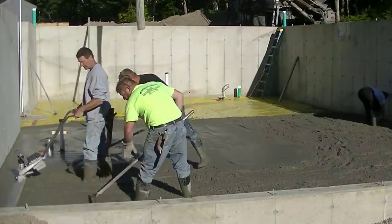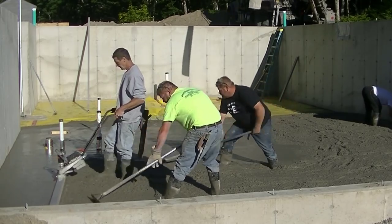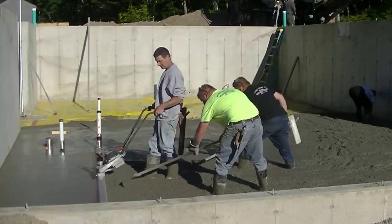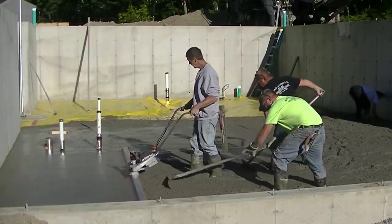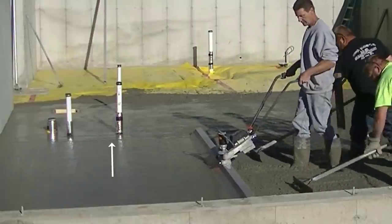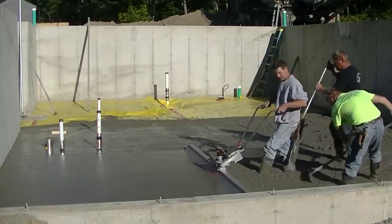Now you can watch me using this power screed. This is the Screed Demon from MBW — this is their new battery operated one, and I've got a link for it down in the description. Look at the effort I'm putting into this — it's very little effort to screed using this. Really the two guys raking, Darren and Luke, are the ones working the hardest. They're keeping the concrete just a little bit higher than the screed — about a half inch to three quarters of an inch high behind the screed. The end of the screed — what I'm looking at is I want to leave a little line when I'm screeding on each end. That tells me I'm nice and flat and level, and I'm not leaving a hump or digging in leaving a dip.